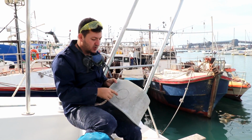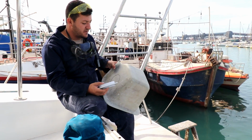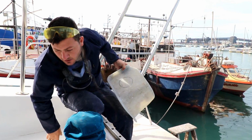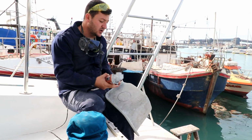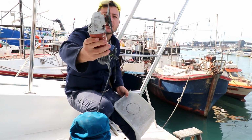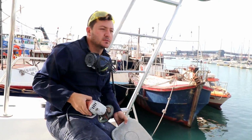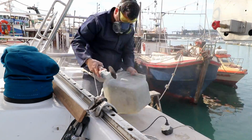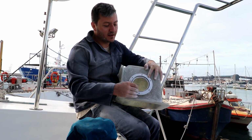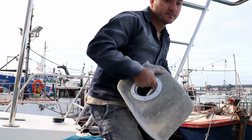And then we're going to put a little access on that, because once we bond it in, she's in for life. We've got one of these little access plates on there, and I'm cutting it out with one of these grinders, because I've got to go through almost 10 mils of glass. It's the first time using one of these discs, but check it out, it's like a curve. See? You've got to take off a guard to use them. So there we go, there's the hole made and the cover. Always messy to cut with fiberglass, but it gets it done quick.